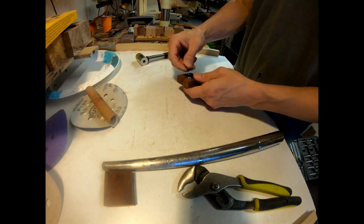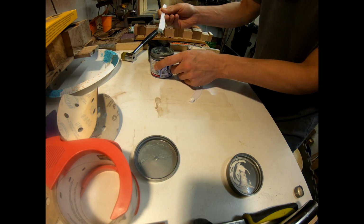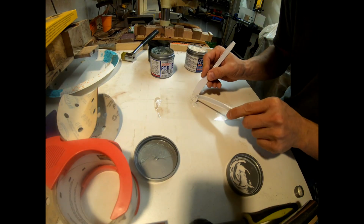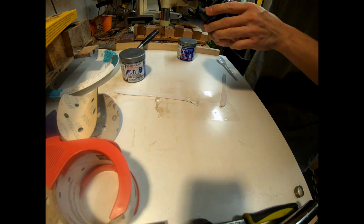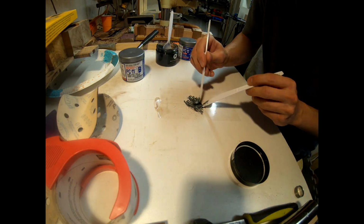Now that the hole is ready, I can prepare the epoxy paste. This is a 2-part epoxy and I'm adding in some black pigmentation so the glue line isn't noticeable. I don't normally use any coloring in the glue, but once the epoxy paste is completely mixed, it's a bluish white, so that's why I'm concerned about the glue line.